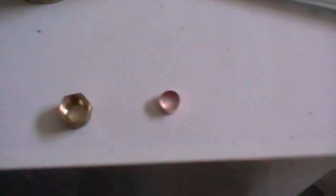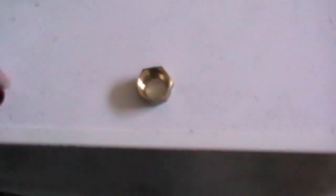Onto my pipe I need to put — I think if I remember right these are called olives. I worked at B&Q many years ago and I'm sure they are called olives. We need to slide that on along with the nut — nut first, or I could put the nut on the other side. So nut first, and then the olive. The olive acts as the compression between the pipe, so it tightens everything down almost like a washer. I'll put that in place and do the same to the flexi hose, and that will have that side plumbed up.